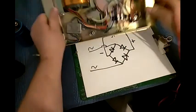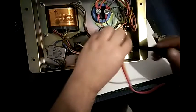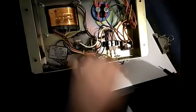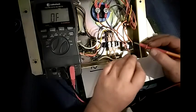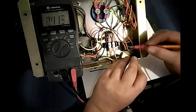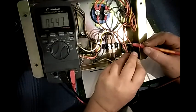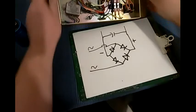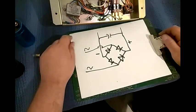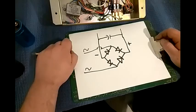I'm going to test this guy right here. There's the positive terminal. I'm going to test here to here — that's good. Here to here — that's good. Here to here — that's good. Here to here — that's good. I just tested all four diodes inside that rectifier. This may be really simple to some of you, but I know there are guys out there where even simple electronics can be a mystery. Hopefully this helps you out.